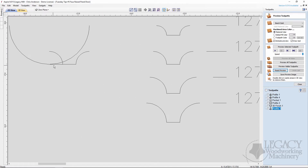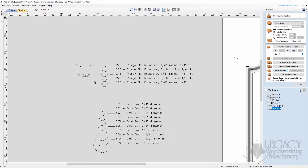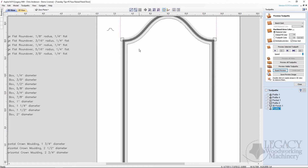We had to adjust the spacing between these cutters so that the core box doesn't accidentally hit the radius of the smaller tool. There's also a flat surface that needs to be machined with an end mill or straight cutter. We have vectors that those cutters will follow — let's show you those toolpaths so you can see what that looks like.